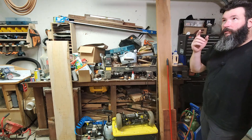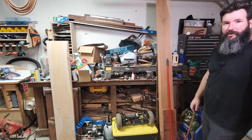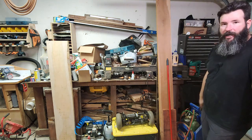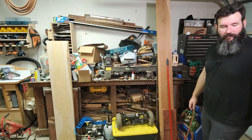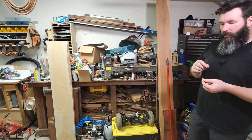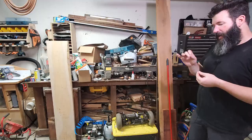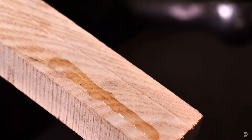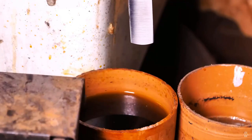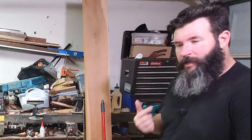Speaking of Alex Steele — he did a video a while back doing a Damascus straight razor. At that time he was experimenting with streaming on Twitch, and he was doing the prep for the acid etch. He would take clear fingernail polish and put it along the cutting edge of the blade to protect it from the acid, and he was having a very hard time keeping it neat. So I said in the Twitch chat: why not just put some fingernail polish down on a board and dip the edge of it in there? And he said 'bloody heck, that's brilliant' — he tried it and it made it into the video. That was my idea — my 15 minutes of fame.